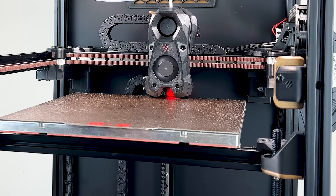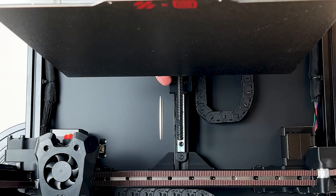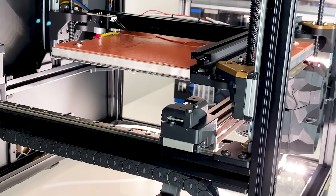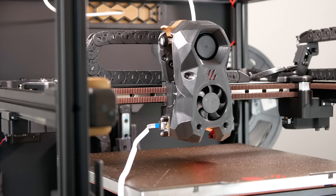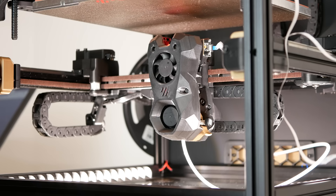One important note: the default nozzle-set homing does not work anymore, as the used shaft falls out of the assembly when upside down. I simply went homing with the inductive probe, which works, but accuracy suffers. I was super curious about the results for input shaping at the upside down stance, so I started by measuring the resonances for both stances. This is one part where the LDO kits for Voron printers shine — they include the input shaper tool kit, which makes measurements with the ADXL345 really easy to assemble, configure and perform.